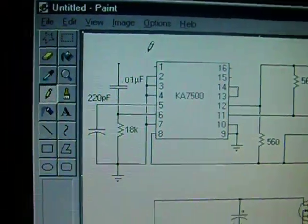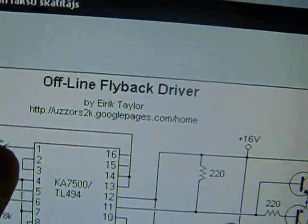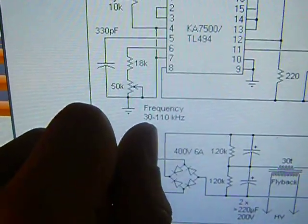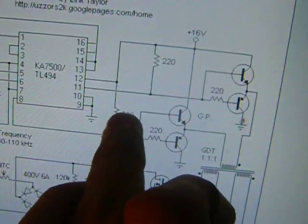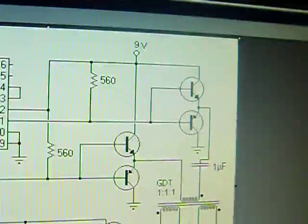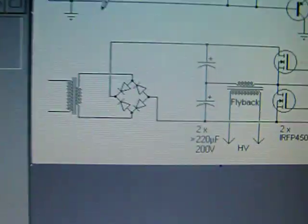This is the schematic I chose. That's the audio input. I'm not using a duty cycle adjustment for the frequency — I couldn't get the chip working with it, so I shorted pins 2 and 3 to ground. The original spec shows 300 picofarads for a maximum of 110kHz. I eliminated some resistors because they overheat the chip very easily. There's my resonant capacitor, the flyback transformer.